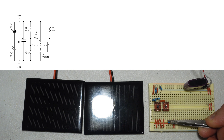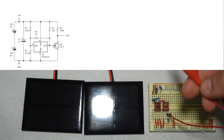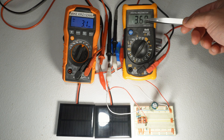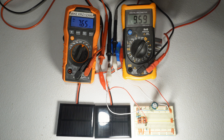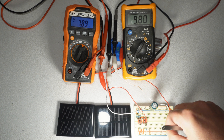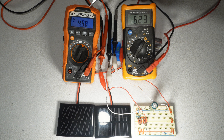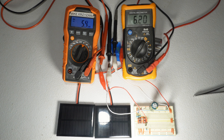This particular voltage supervisor is glitchy below one volt, so I want to make sure the robot is definitely off at low voltage. A JFET here filters out any low-voltage glitches. When I switch the light on, the capacitor starts to charge and the output stays off. When the voltage reaches 9 volts, the output suddenly switches on. I'll shove a resistor in to simulate the robot switching on — you can see the voltage drops as the capacitor discharges, and the output remains on until the voltage falls to six volts, then the output switches off and charging begins again.